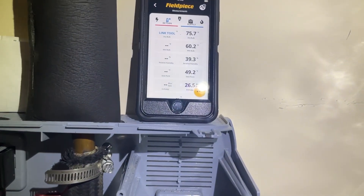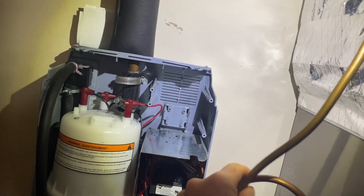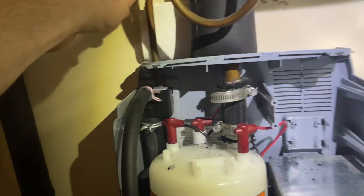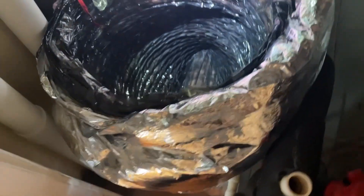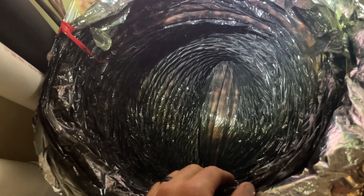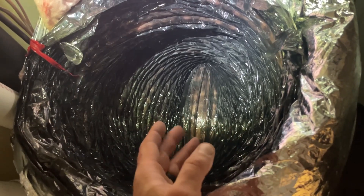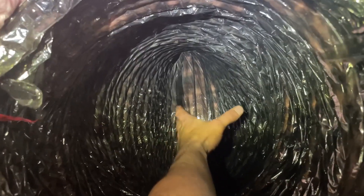The humidity is coming up. I'm not sure how long I'll let it run. One thing I noticed — this is just flapping in the breeze here. So that's going to be the condensate trap, and that needs to go right over into there. I have no idea why that was left out. Now I have no idea what this other thing is about, but you want to be careful not to try and fix stuff that's not broke. I don't know why this is here and I'm not just going to go removing it, because then you have a resident saying the furnace is too loud. But what I will do is get this strapped back. I don't like this restriction right here.